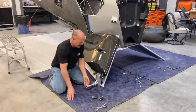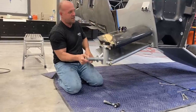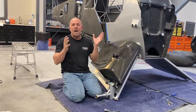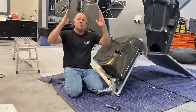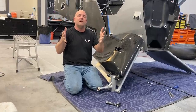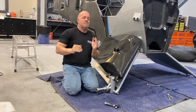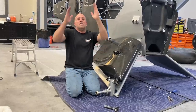If you look right here, see how the axle stays level to the ground as I go up and down? You can see this knuckle travels through this arc — all designed in the computer for the carbon fiber — but the axle stays perfectly level relative to the travel. Typically a Cub has anywhere from 5 to 10 inches of travel, but as the travel goes up and down the tires lean in and out because the axle is fixed to a single A-arm and welded at neutral stance. What I wanted was 20 inches of travel, and I ended up with 20 and a quarter inches of travel while maintaining the tires level.